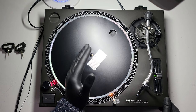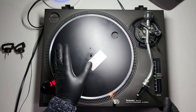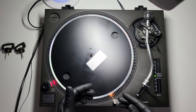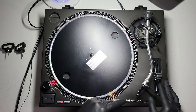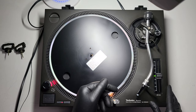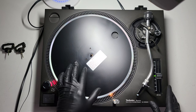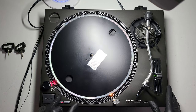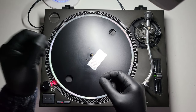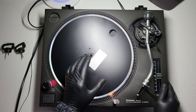Dim LEDs — easily sorted. It could be a main board issue but nine times out of ten you can replace the LEDs and do the work on the main board to get the brightness back up. Decks that commonly have blue, green, or white LEDs — what I tend to see with the majority of these turntables that have had upgrade kits fitted from eBay is they'll put a new LED on the pop-up, pitch, 33, 45 — everywhere. You need to be wary of this: unless that person is competent with soldering there's every chance they can cause more damage than good to the boards.